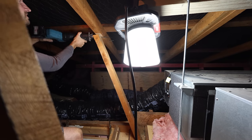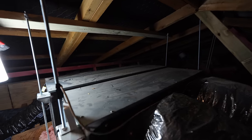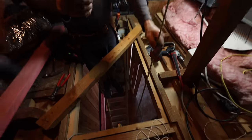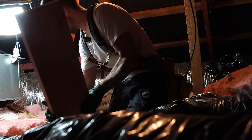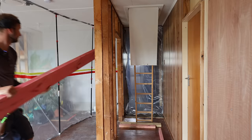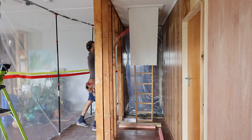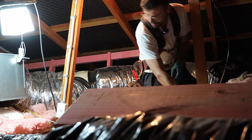Back to the beam. Good news — we can remove this strut here. Turns out this was the only rafter with a supporting strut in the middle, and with the new big beam at the bottom it wasn't necessary. Which means we only need to replace one strut. We want to prop all the way down to the floor, then the roof is supported and our way is cleared for the beam.